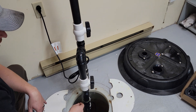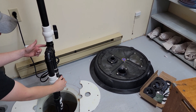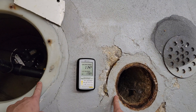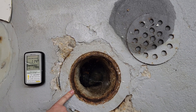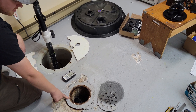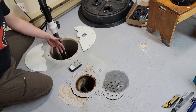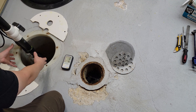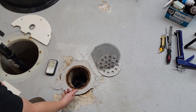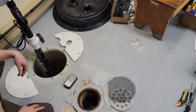The sump comes out and goes up and out of the house. In the winter time, because we're here in Winnipeg and it gets very cold, the way they decided to route it was: you shut one valve and open the other, and there's a corrugated pipe that flows between the sump pit and the existing floor drain. In the winter it'll pump any water into the floor drain. All the weeping tiles flow into the floor drain, not into the sump pit - that's the way they did it back then.